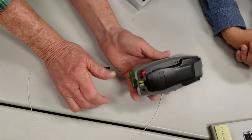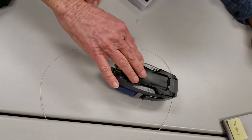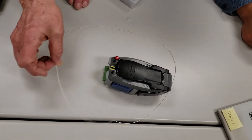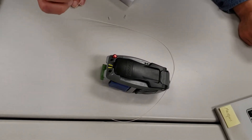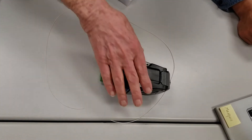That's what you want. So you always want to put your connector in the tool first, because after we go through the steps to prepare our fiber, we want to go straight into the connector. We don't want to take a chance on getting it dirty. Always put the connector in first.